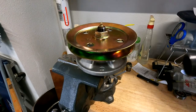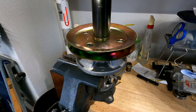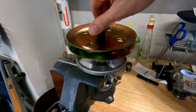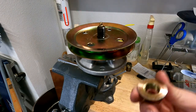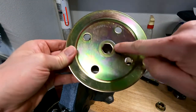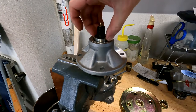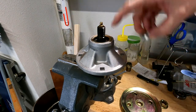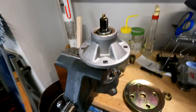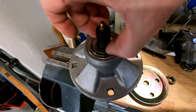All right, let's crack into this thing — I will show no mercy. A 27 mm socket fits pretty good on that. The pilot for the pulley is the same; it's got this hexagonal feature. So if this seal was any good, I should not be able to pull this bushing out so easily — but it just dances around in there. There's 20 thousandths or so worth of play in there.